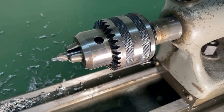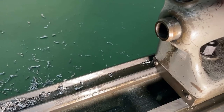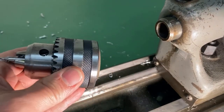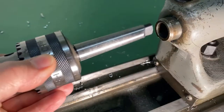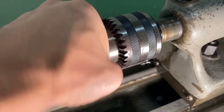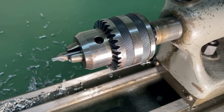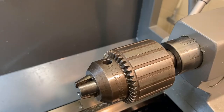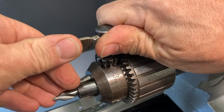Any time you put a taper in, it needs to be spotless and free of any chips or fingerprints. What I like to do is wipe them down with a little WD-40 and then wipe that completely off. If you have trouble getting them to stick together, wipe them down with rubbing alcohol. Generally they'll stick if you wipe with WD-40 and then get it completely dry. Make sure the last thing on those surfaces was not your fingerprints — sweaty fingerprints will cause rust. Things in the machine shop tend to be made of tool steels and carbon steels, not stainless. Once the drill chuck is installed, put the center drill into the chuck and use the key to tighten it down.